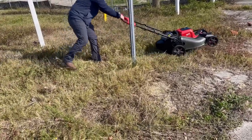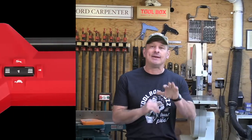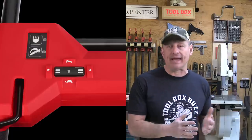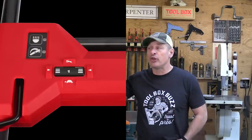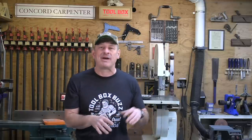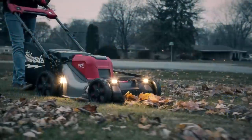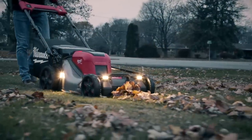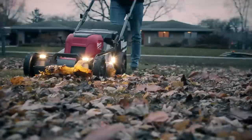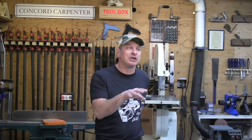There is a high-lift selector that increases blade speed from 2,800 to 3,300 RPMs. Users may want to engage this mode for better bagging or finer mulching — for example, in the fall in the Northeast to help pick up leaves while mowing. Engaging high-lift mode illuminates an LED light on the dashboard letting you know it's activated.